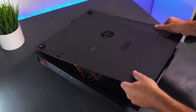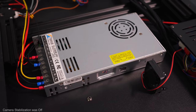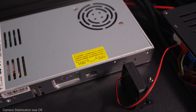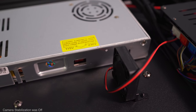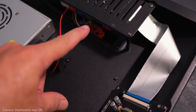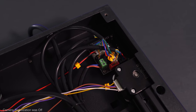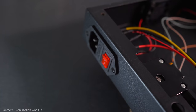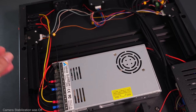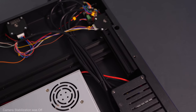With the six bolts out, this is what we see underneath — all very clean. There's a really slim 360-watt 24-volt power supply. Mine is already set to 115V, but you can switch it depending on where you live. We have the main board with a nice shield, a cooling fan for the drivers, a Makerbase display board, two Z-axis stepper motors, a Y-axis stepper motor, a junction box, a fused AC plug with an on/off switch, and aluminum channels on the inside to strengthen the bond between the gantry and the base. Very nicely thought-through design.